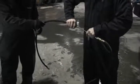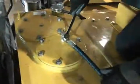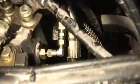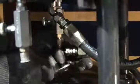Blow out the hose assemblies with high-pressure air, ensuring all debris is removed. Now it is time to attach the hose assembly from the drain port to the outlet of the G2F unit, and also install the hose assembly from the pressure port to the inlet of the G2F unit.